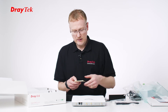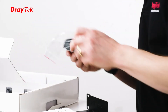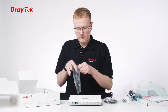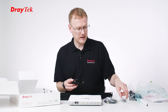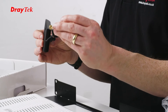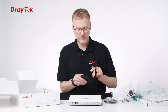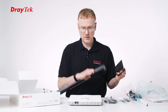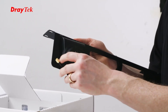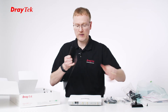We've got a wall bracket and a little post-it note. Here we have the LTE extension cables — there are two of them. These are really useful because if you're mounting the product inside a rack, you'll find that the aerials will be at the centre of it and might be impeded in their signal. By connecting them to these extension cables and mounting them on the outside of the rack, it increases the signal strength, so that increases the speed you'll get on the mobile broadband. One of the nice things about this is it's magnetic, so it sticks to the outside. You can quite easily mount it on the outside of a rack and feed it through into the router, and it then gets a better signal strength.